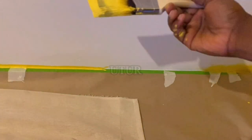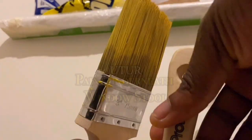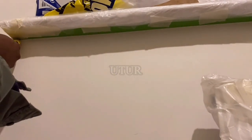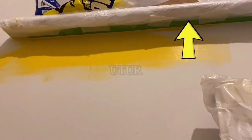This is where the angle-cut paintbrush comes in handy. I am using the two-inch slanted angled brush to paint underneath the window stool. At the right-angled complementary angles I have the painter's frog tape and a polythene film sheet that's been used to cover the window stool, because I do not want paint to get on the window stool.